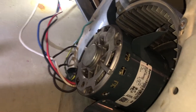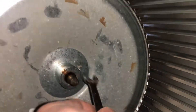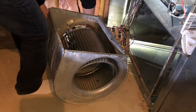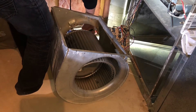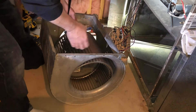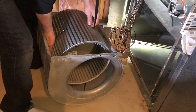I got all four screws off the motor mount. There's one more screw that will separate the squirrel cage — sometimes it's not soldered but can be very hard to get off, especially if it's been on there for 10 years. You may have to bang it out. Now I'm sliding the motor out — mine was rough. I had to use a crowbar to almost pry it out.